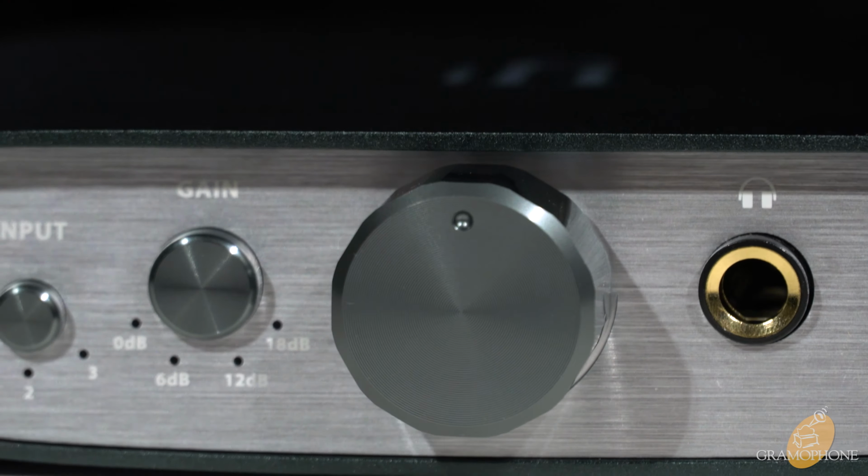The output amplifier actually driving your headphones in this device has 4 different gain steps in increments of 6 decibels each. So you have power for days and excellent control of it. Of that gain control, the 4 steps you get are the standard 0 decibels, +6, +12, and +18. So you have extra volume for days for almost any headphone need.